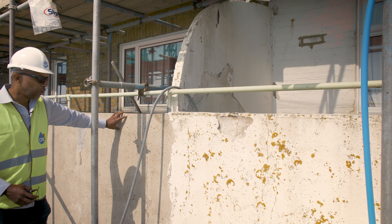This is one of the brick pillars that we've done. You can see that over the years different forms of pointing have been put in. The current contractors are going to remove all the pointing and repoint, because that has a big implication on the water tightness of the property.